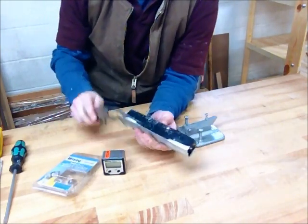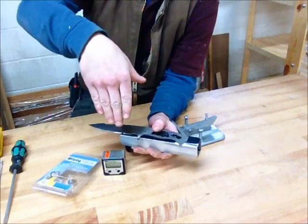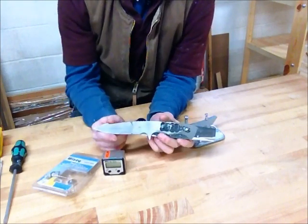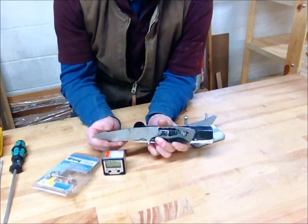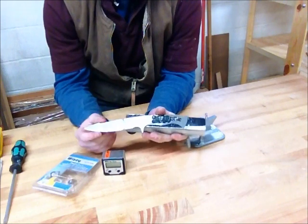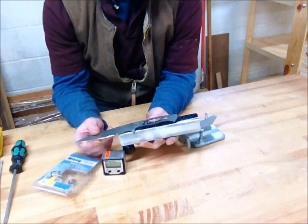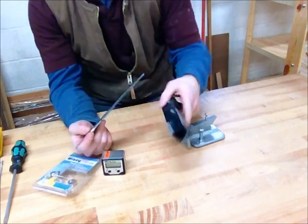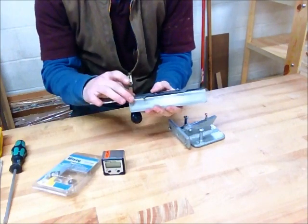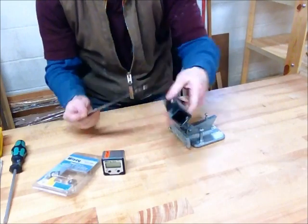This one required that, because my table does not tilt forward toward the belt, I had to grind the bevel down — or the tip down, or the edge down. That was fine for my first couple knives, but then I realized I could not see the edge and could not see if it was getting overheated, so I did burn a few edges. The edge isn't actually touching the aluminum, so that's when I ran into that problem and decided to make a new one.